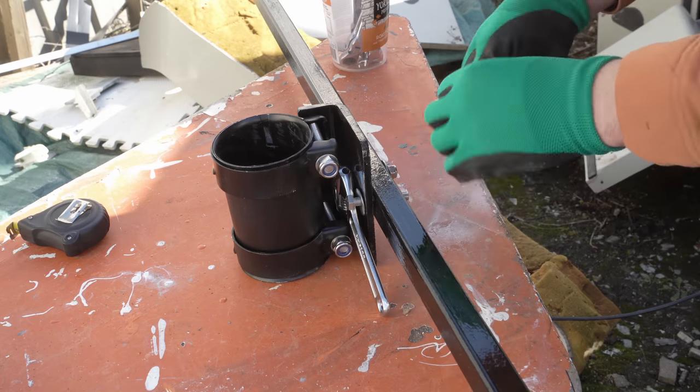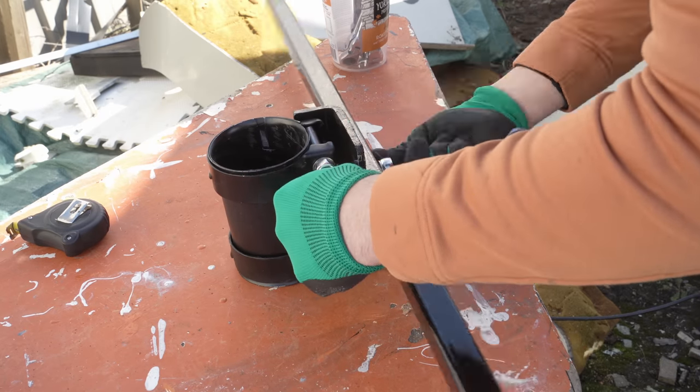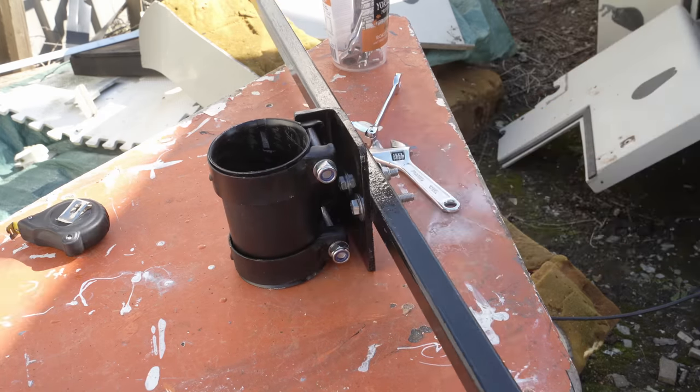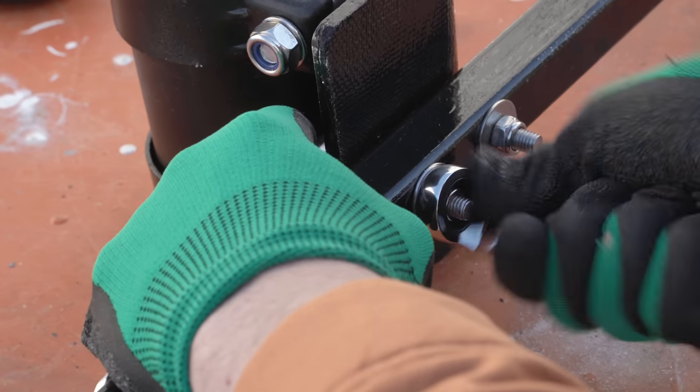As I do up all the bolts, I do need to be conscious that flagrant, overzealous wielding of spanners could over-torque and deform the box section. I'm using wide washers to spread out the clamping force and trust that all will be well.